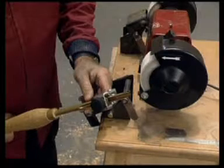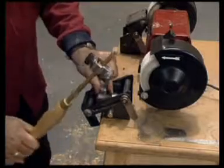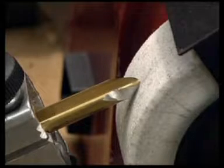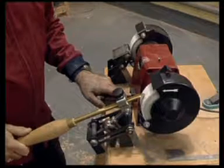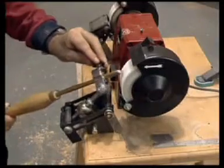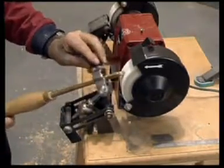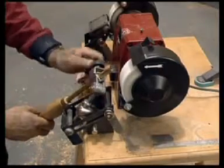Lock the gouge into position with the clamp screw. Offer the tool to a stationary wheel and check that the bevel is flat on the wheel when viewed from the side. Reduce or extend the projection as required to match the bevel. It's a good idea to measure the projection and keep a note of this handy for all future sharpenings. With the grinding wheel running, grind each of the wings first. Finish by rolling the pivoting arm smoothly from side to side until you achieve one clean pass.